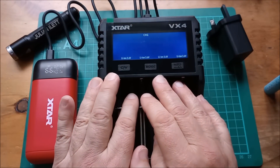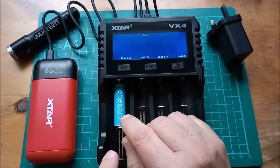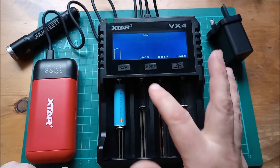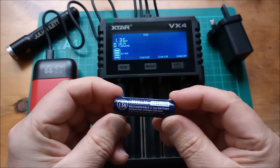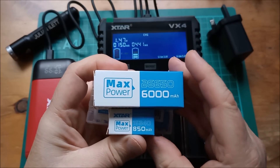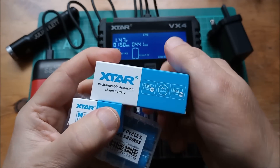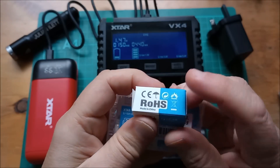I've put it back to lithium ion 3.6 volts. Let's now start putting some cells in — so I'll do an Eneloop nickel metal hydride. Now, AA cells seem to need a slight wiggle, but I'll come back to that. Let's put in one of these 1.5-volt lithium ion rechargeable cells. XTAR kindly supplied some of their max power cells — this is a 26650 lithium ion 6 amp-hours, with a sustained 10-amp discharge current. And this is a little 16340, 850 milliamp hours, with a 2.5-amp discharge current.